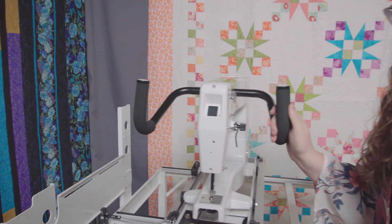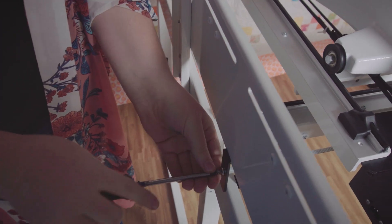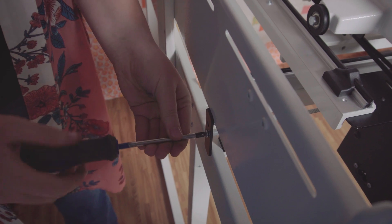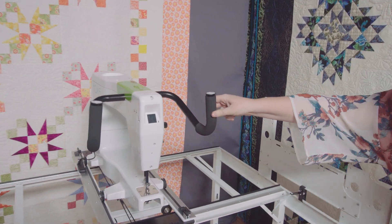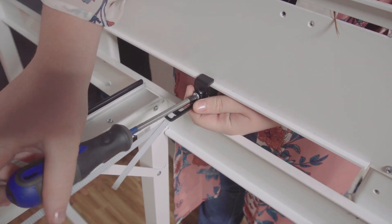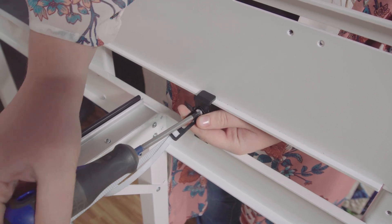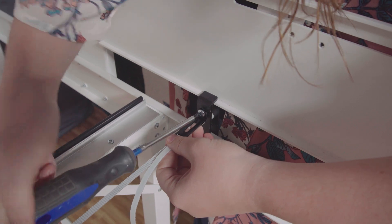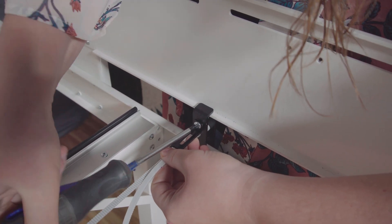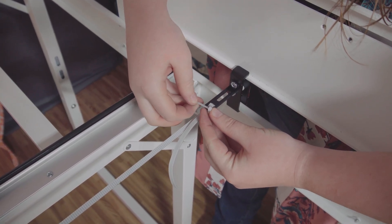Move the Moxie on the carriage all the way over to the left-hand side of the frame. Line up the X bracket and pulley on the robot so that the belt is straight. Tighten up the X belt bracket so that it stays put. Now move the machine to the other side and do the same there. With the belt aligned, we can now tighten it up. Move the machine to the center of the frame, working at the X belt bracket where we loosened the belt anchor. Pull the belt through the slots until it is mostly tight. Finish tensioning the belt by screwing down the belt anchor. To get the right tension you may have to loosen the belt anchor a bit, adjust the belt in the slots, and then tighten the belt anchor screw again. The belt anchor screw should be fully tightened into the X belt anchor. If this is allowed to flop, the system won't work right.